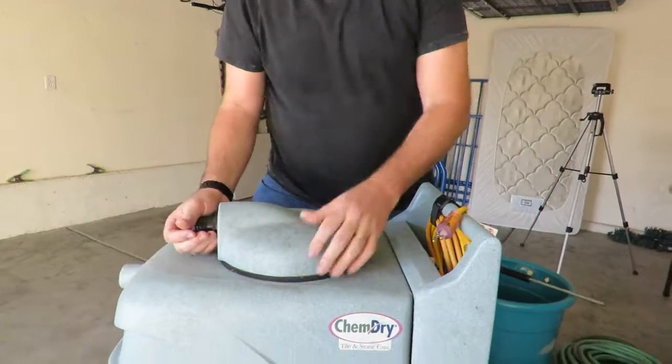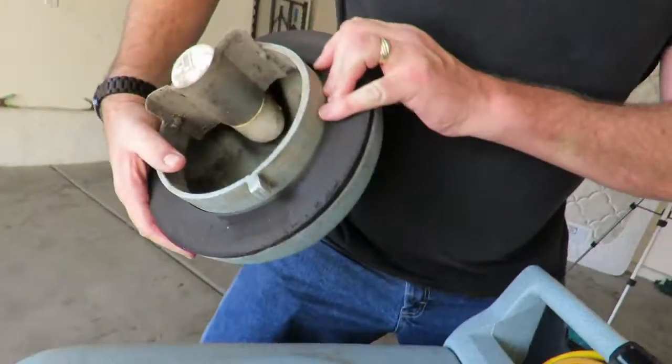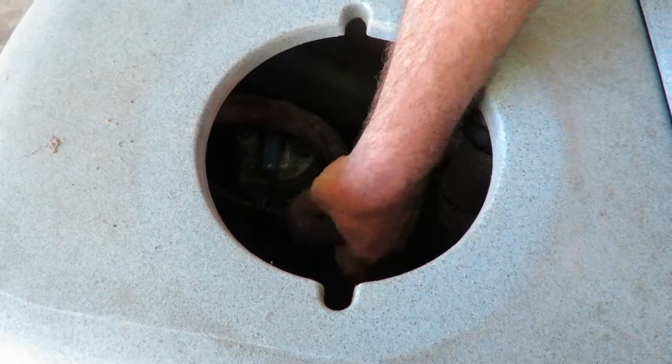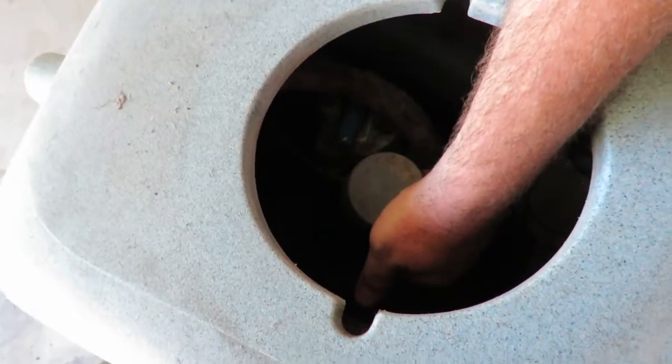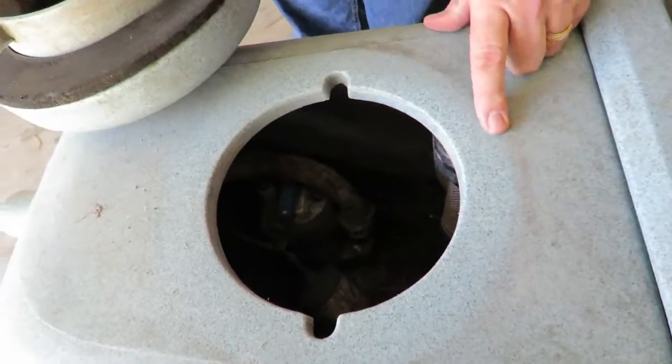Okay, this is the vacuum waste tank. You're constantly going to be in here because when foam's created, you're going to need to manage the float switch. This doesn't work as good as I would like, but when this floats up, it turns the pump on. The pump drains the dirty water out into the toilet.